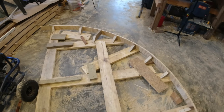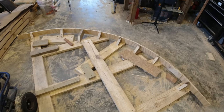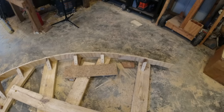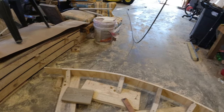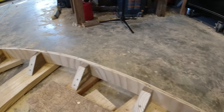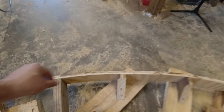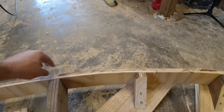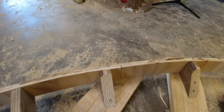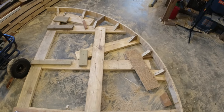Here is the frame we're going to be using to clamp the boards to. This is basically half of the old frame from the last video, and I've added a bunch more supports and little pieces of wood to strengthen it. I added wedges this time along the edge instead of those PVC pegs. Then I added a plywood strip around — basically two layers of three-eighths plywood — and it bent really easily around it. I just screwed it to these wedges and it's not going anywhere. Once you get two of them sandwiched together it's pretty stiff, which gives me a lot of real estate to clamp to. So hopefully that'll be better than last time. Now I just have to wait for the wood to finish steaming.